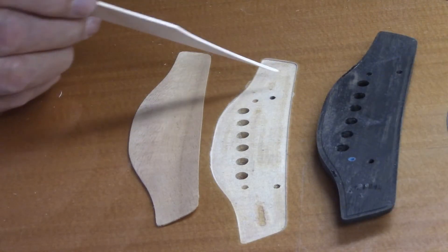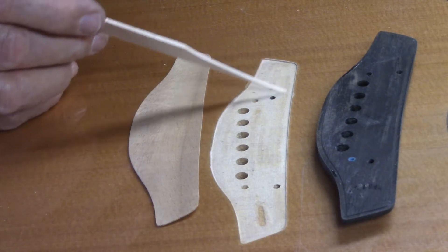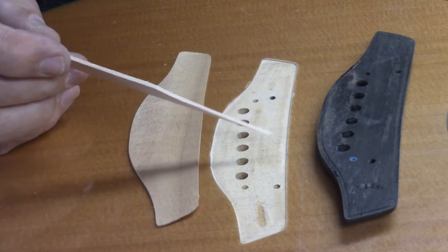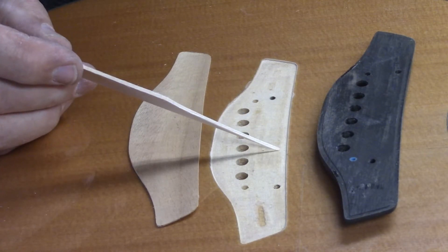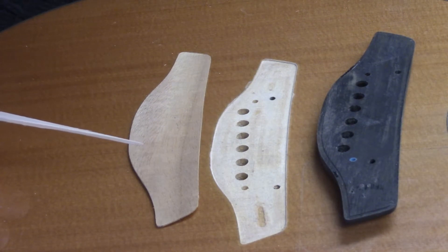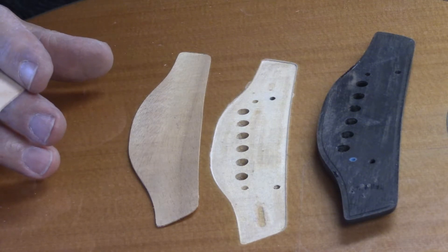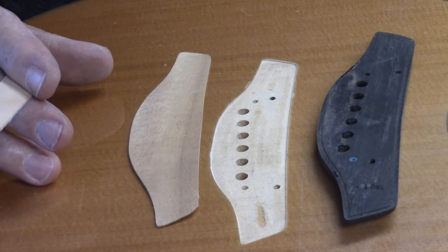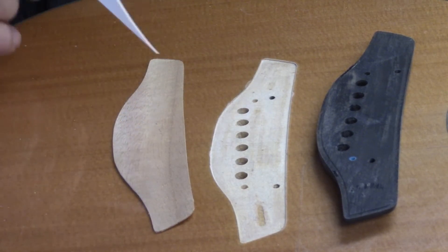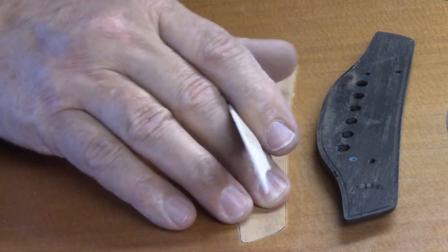If you look closely, you can see the faint line of the glue that I had very gently sanded off flat. It's not just that you're losing this much gluing surface — you're losing this much again. So it's a small wonder this bridge came off and the action was lifting. CNC machines are not always the answer, and I deal with it every day when it comes to dressing frets. I constantly correct. In fact, in this case it makes an inferior joint look perfect. When I'm done, it will be perfect and it will never come off.